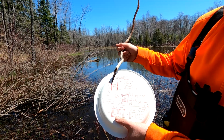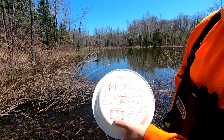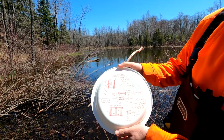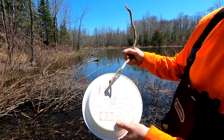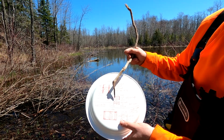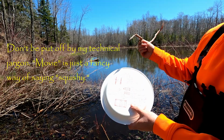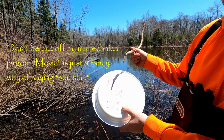And also, because the dock goes about here, you have these posts sticking up, and if you have a boat, you want to touch something when you're coming into shore. You want to grab something, so the railing, but you also want to, of course, moor it each night. The top of the dock frame would typically be 3 feet wide, whatever length you want, and for 3 feet, you want at least 3 center floor joists. Just obviously for stability. You don't want it to be too flexible.